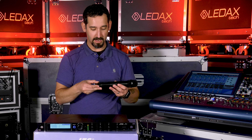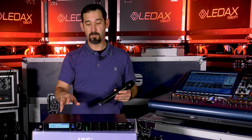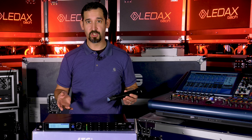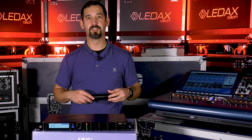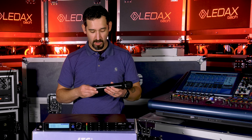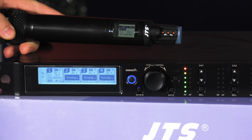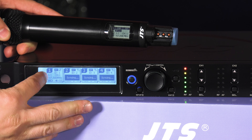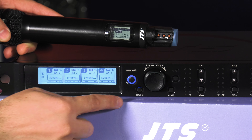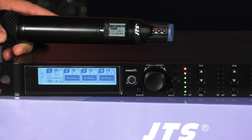I'll zoom in here in a second and we'll do that. But first and foremost, I'm going to set my ID and group and channel information. Make sure you scan for available channels — depending on where you are, that's going to change. Shure is a great place to look; you can type in your zip code and it'll give you areas and frequencies to stay away from. Now that I have my ID set, I'm going to do Remo Set, which is this blue flashing light, making it painfully obvious what you need to do. I've got ID one set here, ID one set here — this is default group one, channel one. I'm going to hit Remo Set. It's going to say syncing... and it's synced.